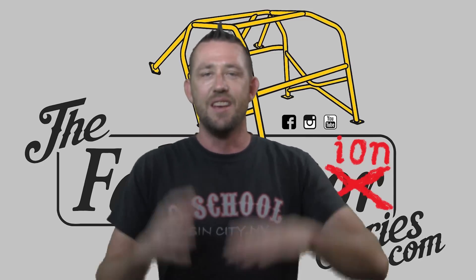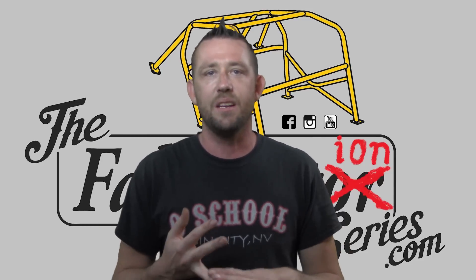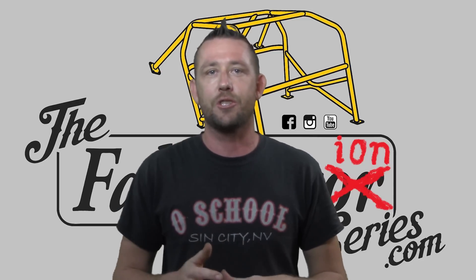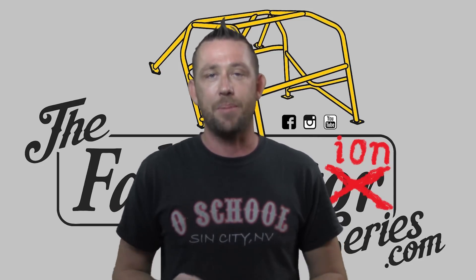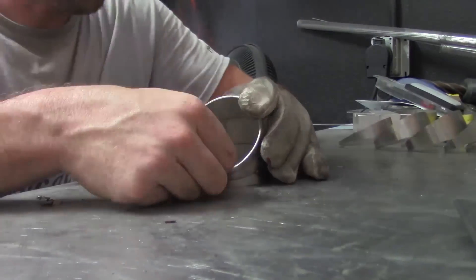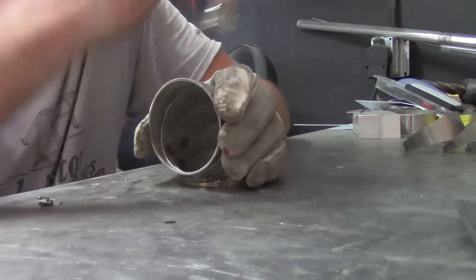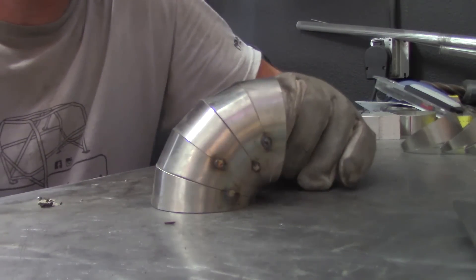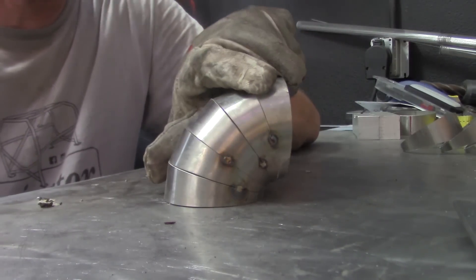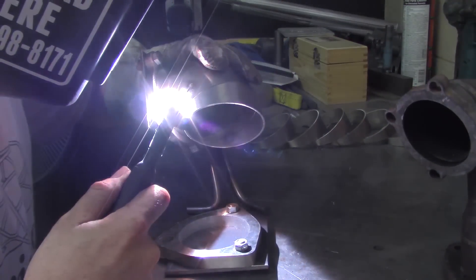But now we get to work on something else. Main questions here: why the hell do we use pie cuts? And my favorite, which is actually more of a statement, is: pie cuts are really frustrating. Well, here's the reason behind it, why we use pie cuts. And this is the footage that I shot well over a year ago trying to make pie cuts part 2 — it's the only footage that survived. These pieces were actually all ridiculously tight. I did 9 degree pie cuts, or 9 degree cut angles, for an 18 degree transition, and if I remember correctly, all of these were done on a 2 inch center line radius. So this ridiculously tight 90 degree bend is exactly why we use pie cuts. Now this piece that I'm making is a dump tube.